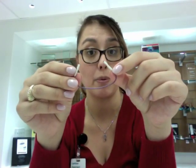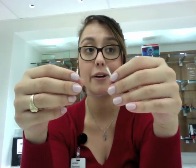A few of the workarounds I've noticed going to see different universities: the first and easiest one is getting male-to-female jumper wires for your breadboard. These are ideal because they don't require any modifications, but they're not really available in most labs, and they're not in those neat little starter packs like the Seed Studio Companion Kit. You can usually get a pack of 100 of them from Mouser for under $13. SparkFun, Adafruit, and other retailers sell them as well — you're looking for male-to-female wires.